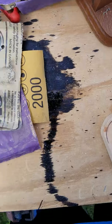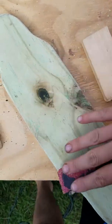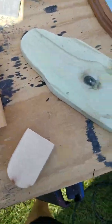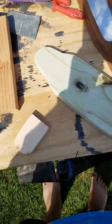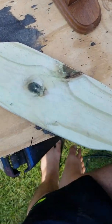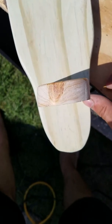Then you can hook up your sander and sand the surface. You can do the final couple of steps in any order you want — the staining, the mounting of the hardware — but you have to do the lacquering last if you decide to lacquer this project. When you're doing the last couple of steps like mounting, you're going to want to use a strong mount for something like this, because this is a small and probably weak joint going right here.